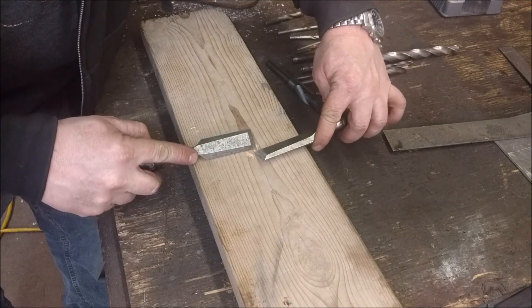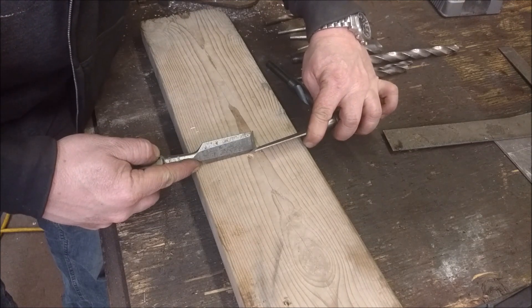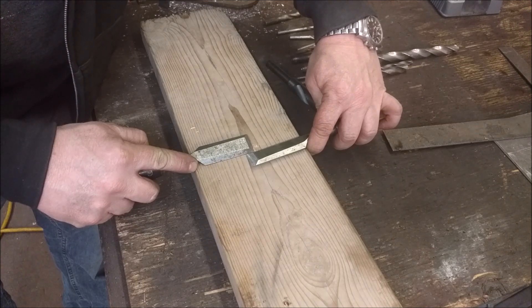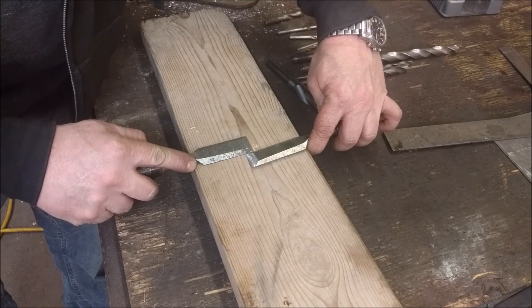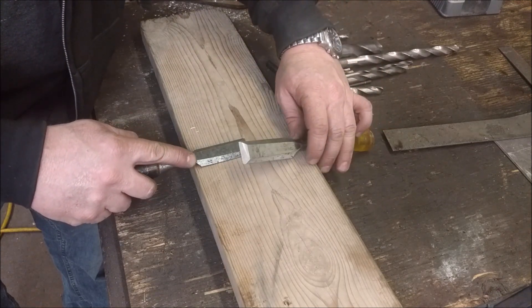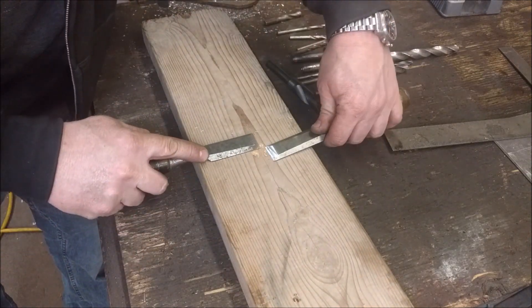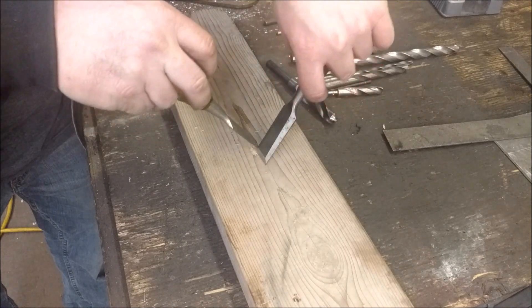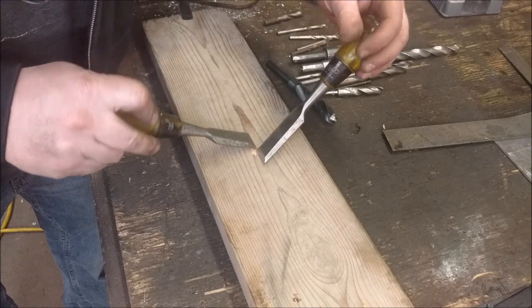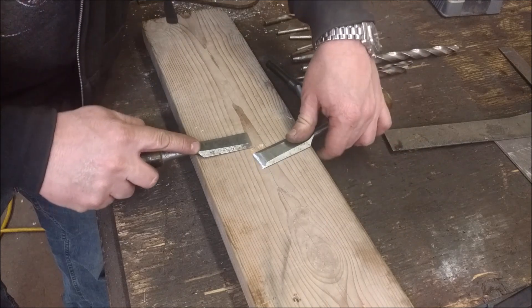That V formation can change depending on the drill bit. The steeper it is, the softer the material. If you have really hard material that you're cutting, specialized drill bits will have a very shallow angle where they're almost flat — it just helps them go through slower. And then you also have the angle at which these dig in. If you had them cutting in real steep, it's almost impossible — it would bind up and more than likely snap the drill bit. Too shallow, and they're just going to skim across the material and not really go in.